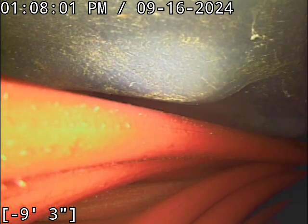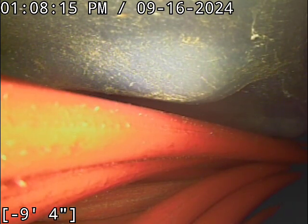Right in front of that, you've got three rocks. My paint can — something sat on the nozzle and the gas leaked out of it, so unfortunately that paint doesn't work — but I snapped a photo and I moved a rock directly over the top of that locate. If you're facing the house from the street, you've got these three decent-size rocks in front of that tree — it's the middle rock. I'm going to take my S pen and draw over the picture so you have an idea right where that is. After any repairs are done, I recommend a re-scope afterwards to check the work — it's very important to do that. You want to do that after the line is buried, not beforehand, or you're not going to catch any settling problems that may occur due to uncompacted soil.